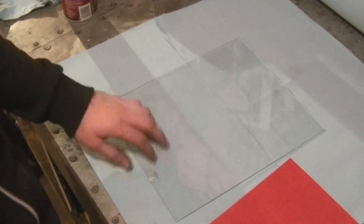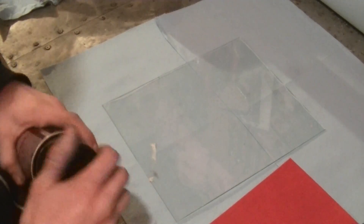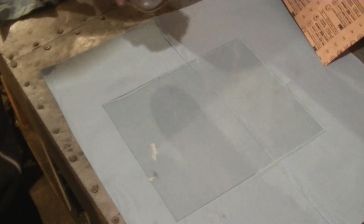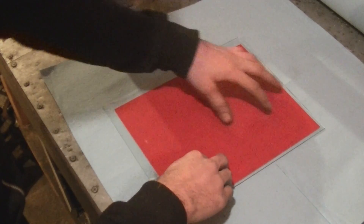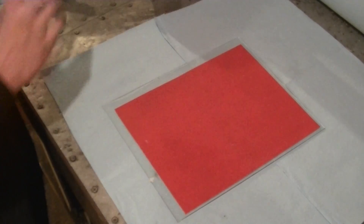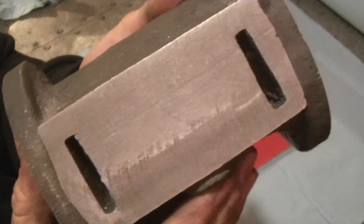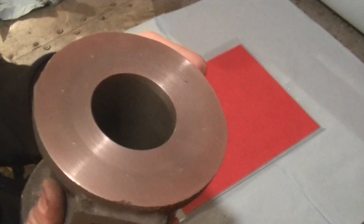The crud is on the other side of the glass — this side is fine. I've got some spray adhesive and we're going to spray the glass with it, then put the sandpaper on. The sandpaper is held stationary while we lap our part. The side we're going to lap first is the side with the steam ports. The fly cutter surface is okay, but it's not going to do for sealing steam — we need to lap it and make it perfectly smooth, kind of like the bore inside. When I lap, I like to wet the sandpaper with WD-40; it helps stop it from clogging. We're starting with 150 grit.